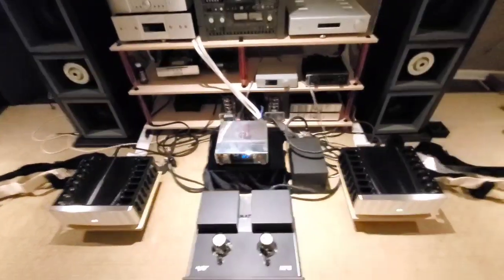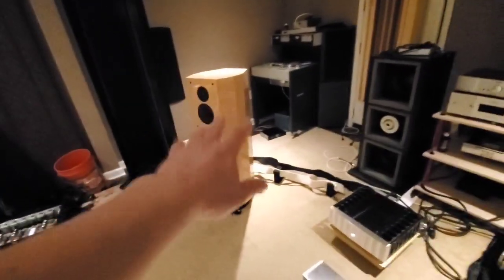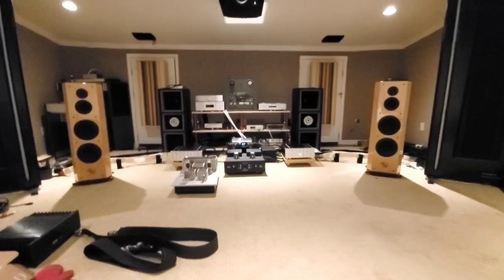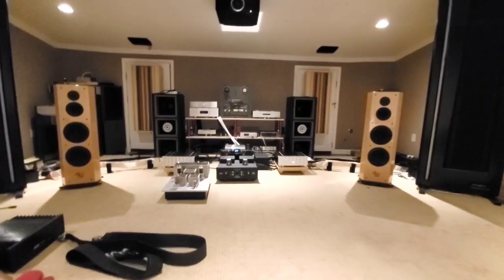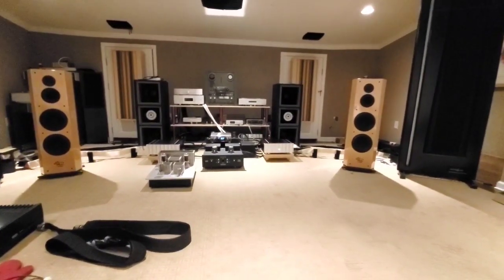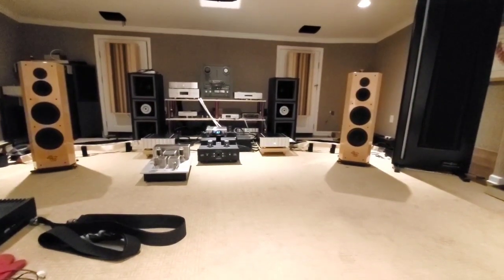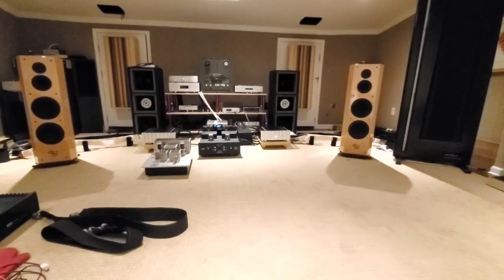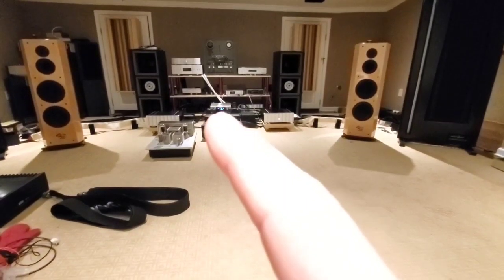It was as good as any of my other NAT pieces that I sold this weekend, which is a bummer - I miss them. We're listening with no subwoofers at all, going straight to the panels. We assembled this slope according to what the manufacturer told me: 650 Hz and a first-order slope, which is very gradual. I think it's too much, so we're going to go to a 12dB second-order Bessel, probably around 650 to 680 Hz.